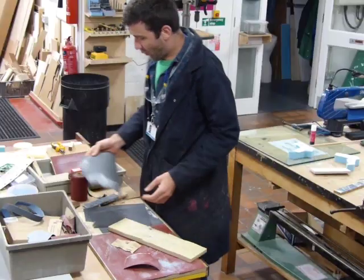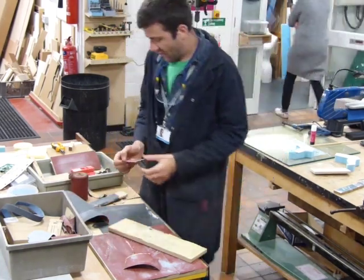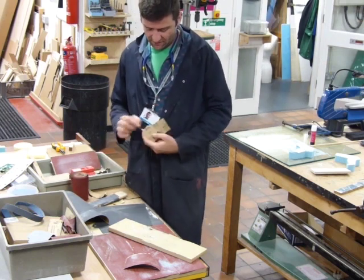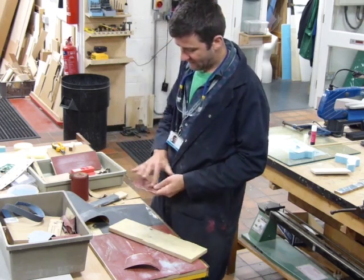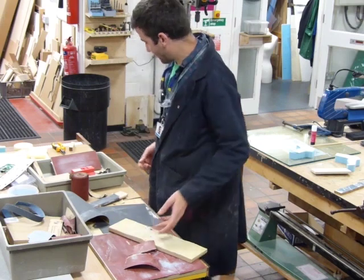So once you've got your PVA on your model, you're going to have to think about sanding it. We've got a number of different grits of sandpaper here. 80 grit, the number on the back, is about the roughest kind of sandpaper we use here. It takes off a lot of material quickly, but it leaves a scratched surface. So obviously you go up to finer sandpaper.